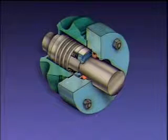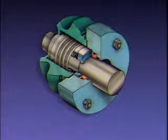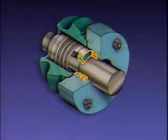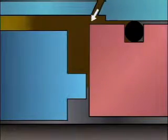While both labyrinth seals and contact seals are used to help restrict the flow of lubricants, they can't be relied upon in situations where it's necessary to virtually eliminate fluid flow — for example, when hazardous fluid is contained in a housing. To minimize fluid leaks in these situations, a mechanical seal is often used. A typical mechanical seal consists of a rotating element which mounts to the shaft and presses against a stationary element which mounts to the housing. Each element has a seal ring; the two rings form a seal with virtually no leak-off. To prevent the seal rings from being damaged, some type of lubricant must be supplied — in some applications the process liquid is used, while in others an external liquid called a seal flush is supplied.